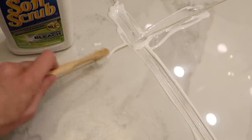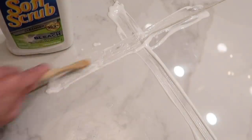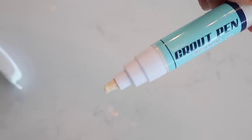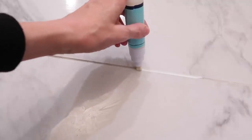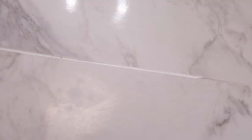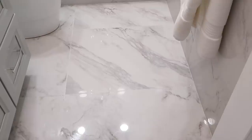The next level up is using Soft Scrub with bleach — this stuff is magical. Using it with a toothbrush on those grout lines will help lift the stain. But if you are dealing with really old, really dirty grout where the stains have been there for years, what you want to do is get something called a grout pen. It comes in different colors — paint it right on the grout line and it looks as fresh as the day you installed those tiles. I personally cleaned the grout first and then went over those crisp lines with the grout pen.